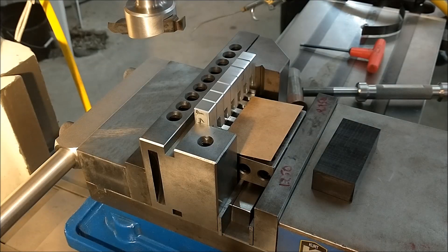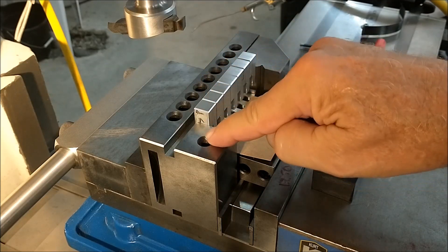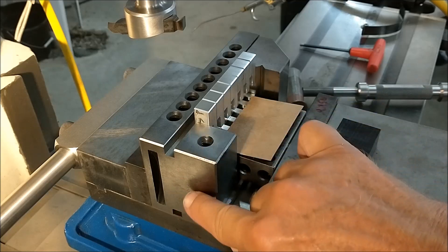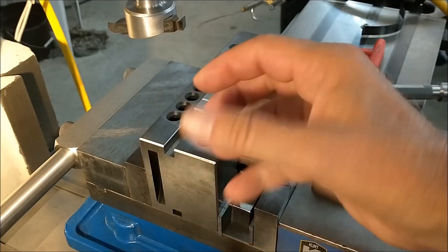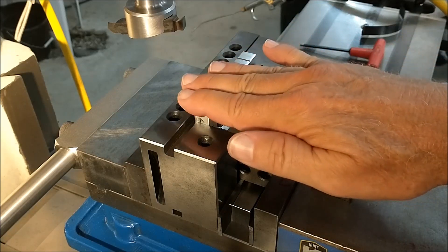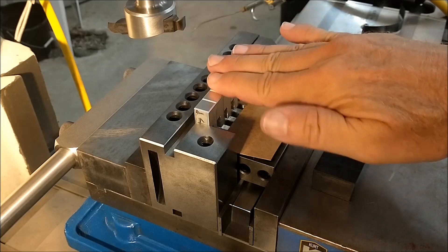This is seven at a time. If the parts are longer than the vise and you can still get away with a setup like this, put this vise up on parallels as well so that the part can project out of both sides. That way you can just flip the vise over and actually do both ends. It's a great way to establish cosmetic surfaces, chamfers and other operations, rounds — very much like Chuck's clamps that he made in his video. That's exactly why I did this.